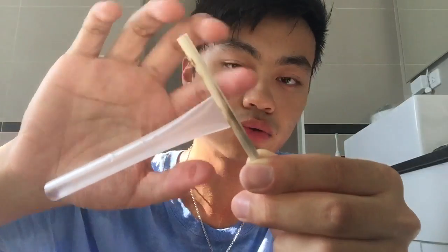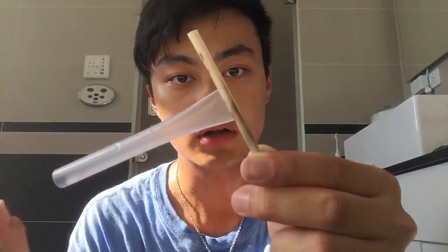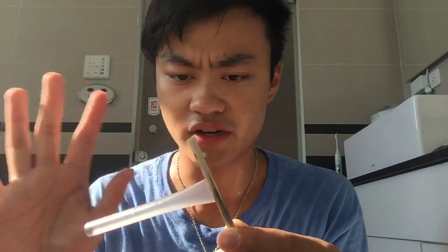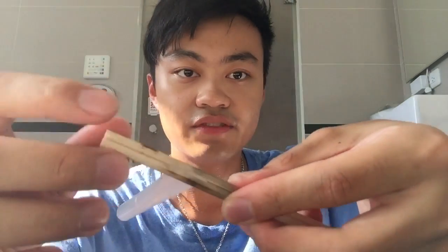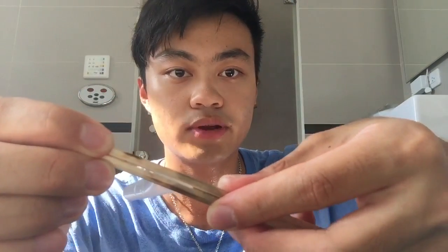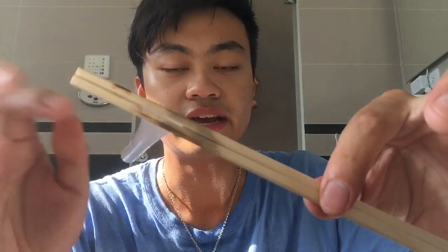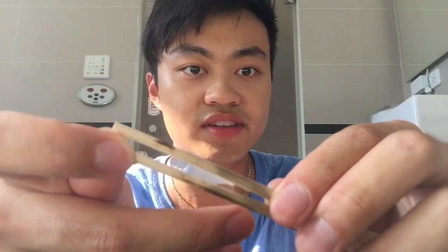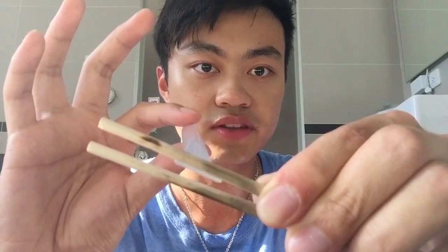To open it, don't just rip it off. If this part hasn't cooled yet and you rip it off, it will stick to your pliers and draw out really thin strands of plastic — that's really annoying and you'd have to burn or cut them off. So slowly take the pressure off the plier, then open it. Sometimes only one side will pop up — just wiggle it this way.